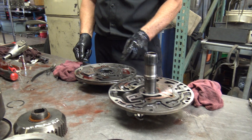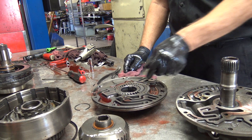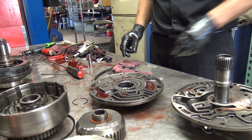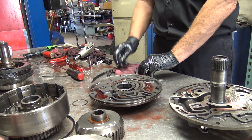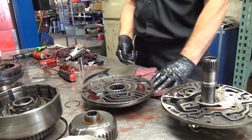Here's your pump — this is what pumps the fluid. The torque converter pumps with it. This hooks into the notch on the torque converter snout, so this turns with the engine. Main pressure.